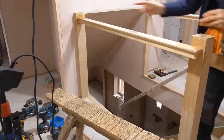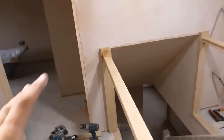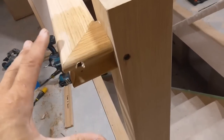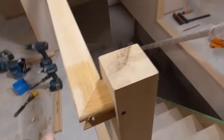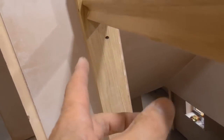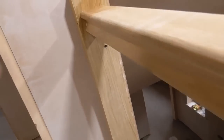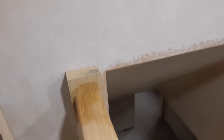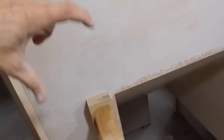All the handrails are done now - I've just got to tidy this up a bit and put a pellet in there when the wood's gone off. Pretty happy with that, it's got quite a nice mitre through there. All these joints are pretty good, hand cut, obviously pellets to go in, that's fixed to the wall. I had to put that slightly off centre just to catch that stud, because I'd forgotten to put a stud behind there to take that half newel - I don't normally forget that. But always when you've got newels coming, if you can put a stud in behind for them to fix, you're going to save yourself a lot of aggro.